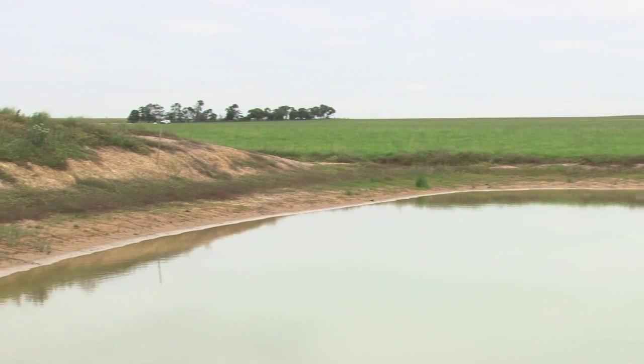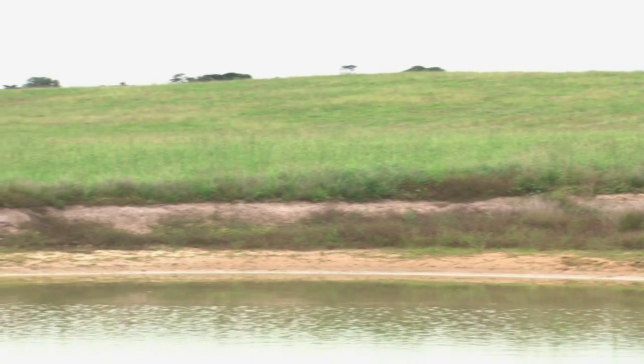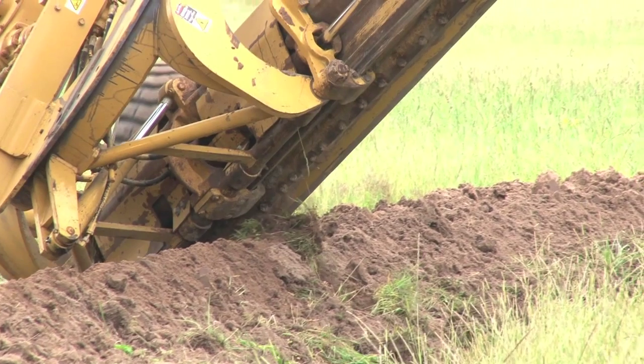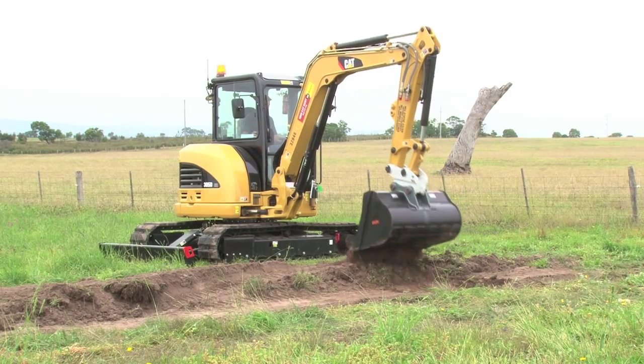Compaction on the swale wall is not what we want. We want a very soft wall so that when water fills the swale it percolates down through the ground and gets absorbed rather than sitting like a dam. The dam and swale will be fenced off from cattle and livestock. With the dam wall, cattle and intense rain over the years have washed and eroded it, so the guys in the grader are reshaping it now, with the excavator driver doing some tweaks at the same time.